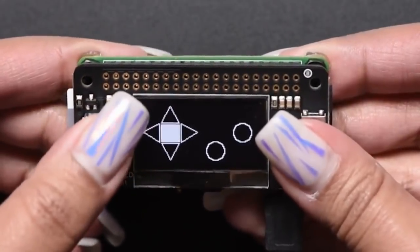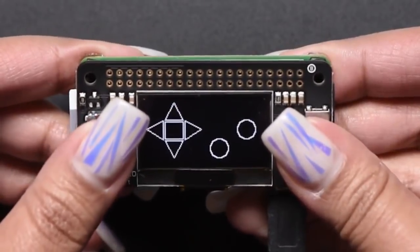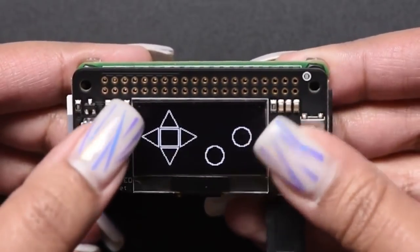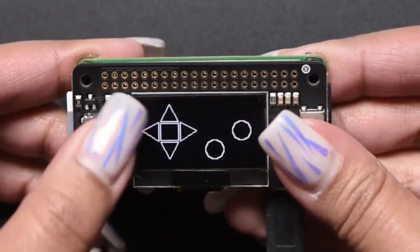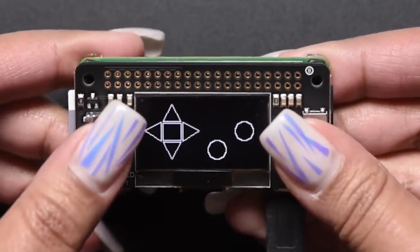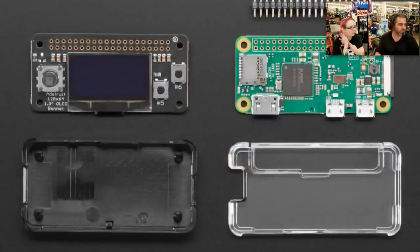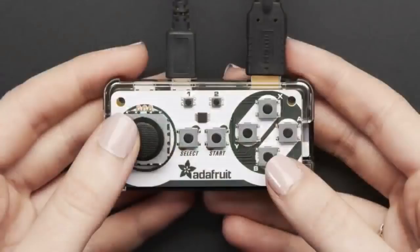Next up, this is a pack for the Pi Zero W. If you want to get started with our OLED bonnet, this is a good pack to get. You get a Pi Zero W, a header you can solder in, and our fully assembled OLED bonnet. As demonstrated here, you can display small bitmap images. It has a four-way joystick and two buttons, plugs right on top — really good for making little interfaces or miniature games. You get everything in one pack at a discount, all you need is an SD card.